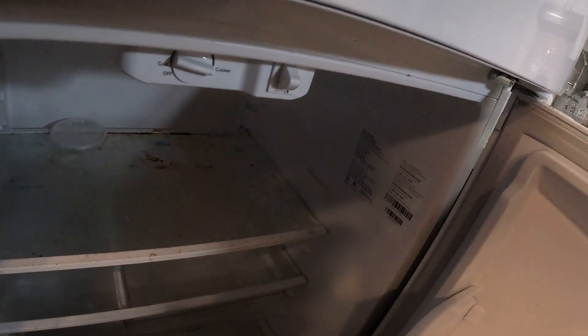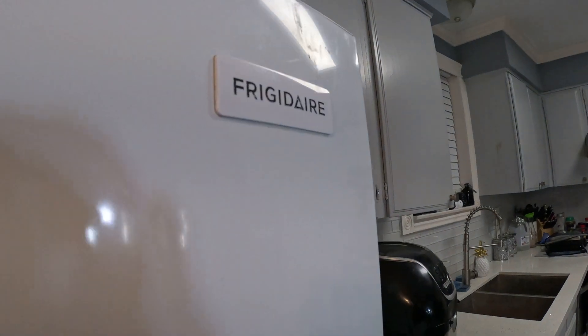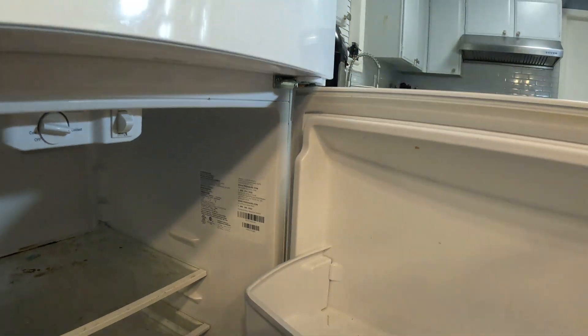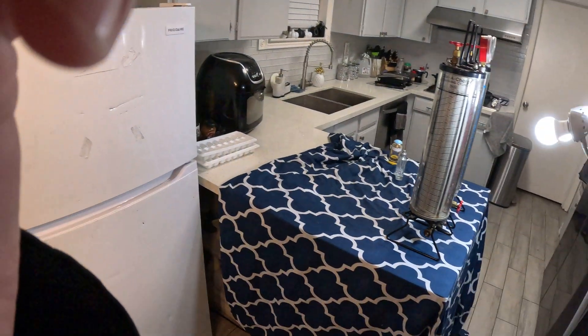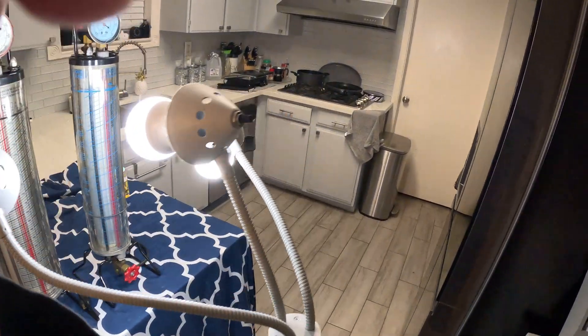How do you really know how much freon you're adding? This Frigidaire unit only uses 1.58 ounces, which is 45 grams of freon — literally nothing. I mean that when I say literally nothing.